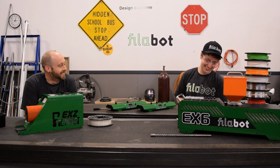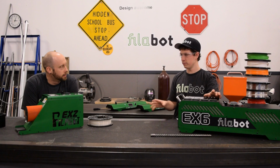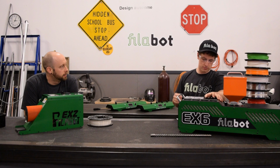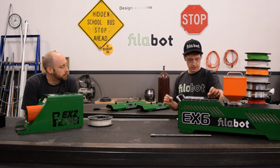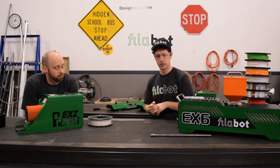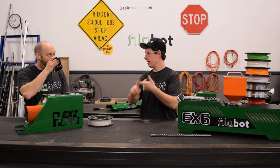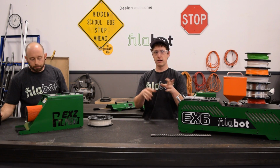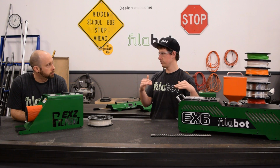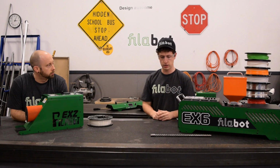All right, in that case, I'll run through the materials listed. The EX6 can do all the polymers that our previous systems can do, plus more. It can do PEEK, Ultem, nylon, HDPE, PETG, wax, and from low to high melt flow polymers. The thing we do want to keep in mind is that there are all these plastic grades, so the ABS, HDPE, LDPE, they all have different melt flows. There is a point where all of our systems can't do certain melt flows over a certain number, but the EX6 takes that wider range and can go further.